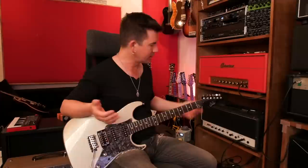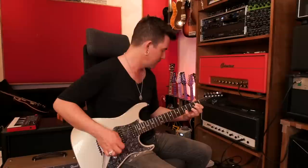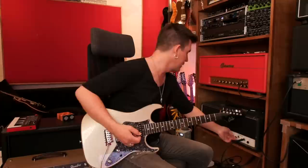With the new three-way switch — something I love doing on Marshall-style amps — you can select no bright cap, a 100 pF bright cap like the early JTM-45s, or a 4700 pF bright cap like the late 60s through 70s Superleads. I'm going to show you the difference in sound, starting with no bright cap at about volume five. Then the 100 pF. And then the big one — the 4700.